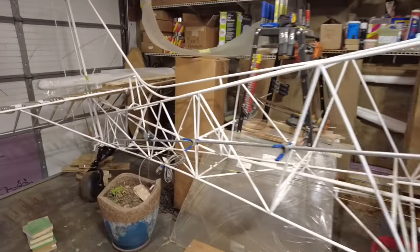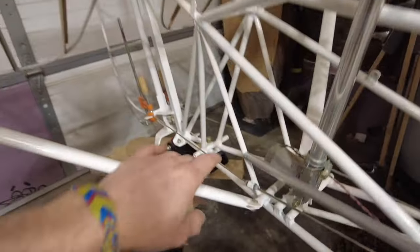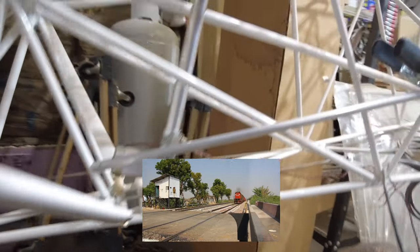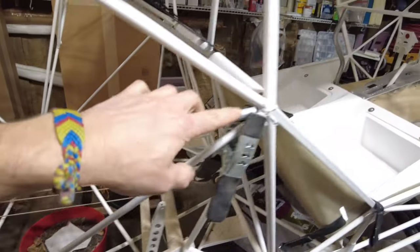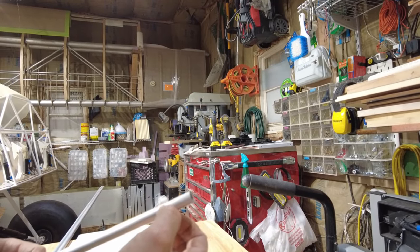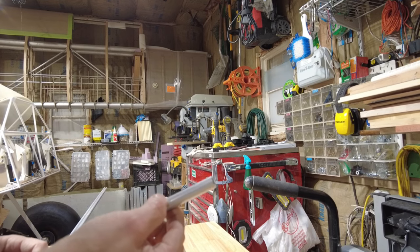Here's the stringer clamped to the fuselage. You measure between this point back here and this point up here. My measurement was tight up front where I'm short, but once I started coping the back end out, that allowed the tube to extend past the framing member, making the front end shorter. I did a pretty good job on the coping, but while doing that I shorted myself up top. I've got these drilled out, ready to scuff and prep, then I'll throw the Hysol on there. Since I have a little bit of tube left over, I thought about cutting a section, making some notches, sliding this tube inside the other and Hysol-ing them together to give it a bit of rigidity.